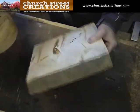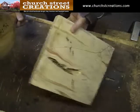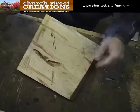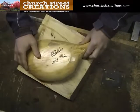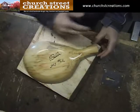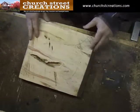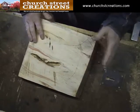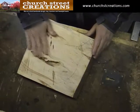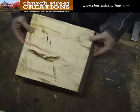So I'm going to go ahead and lay that shape out on a block, which I kind of already did. This block is about 2 inches thick, and it has a pretty terrible void in it. You can see I've cleaned it out a little bit, but it doesn't go all the way through, and I'm thinking I can still make something out of this — it's got a couple of nice flames in it. I laid the bowl upside down on it, and I'll just make a shorter handle. I'm going to remove some material using a chop saw, then clamp to the bench and use the Arbortech Turbo Plane to rough out the shape inside, top and bottom, and then sand it.